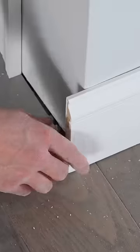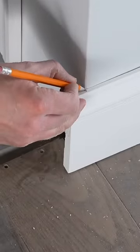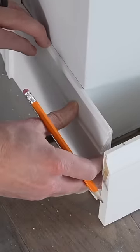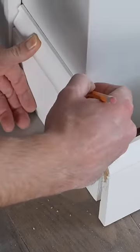I'm going to show you guys how to do an outside corner with baseboard. After you lay your baseboard up to the corner, we're going to mark right where the corner ends on one side. Then we're going to take the other side, move that one out of the way, and do the same to this one. Make sure we're tight up against the wall and we mark the outside.